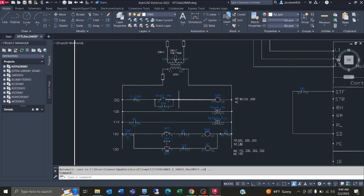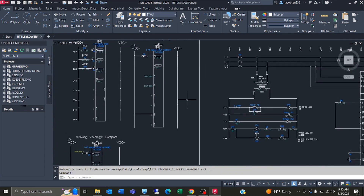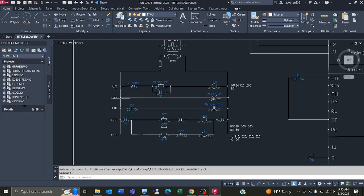Once initiated, it will power on this SPR here and latch this circuit on to create our e-stop circuit. I got normally open contacts for this SPR on rung 90, 120, and 500. Here is the first one, here's the next one, and over here would be the other contact — the AFC switch. The next rung is just letting you know that there is power on, going into this LED straight from the power, so whenever it's turned on it will turn this LED on.